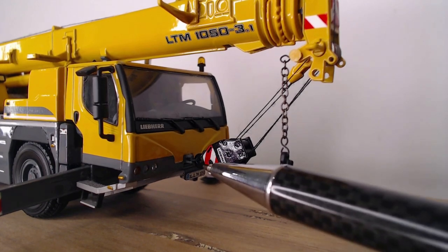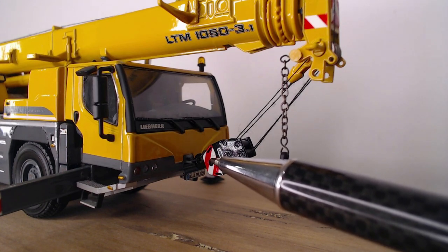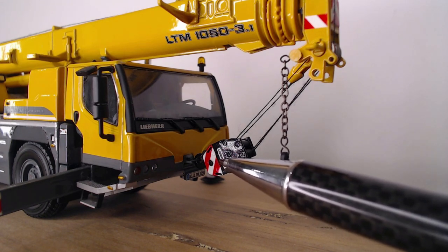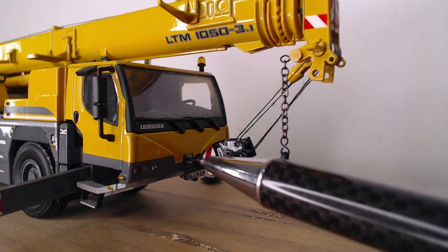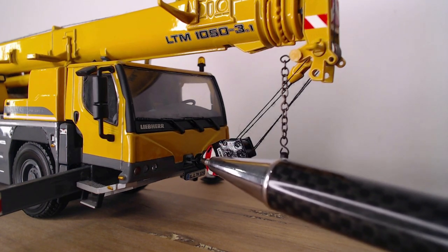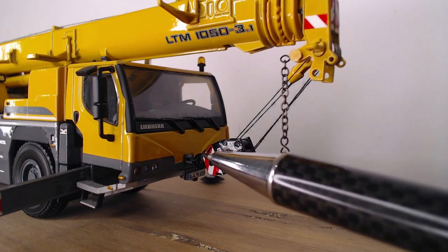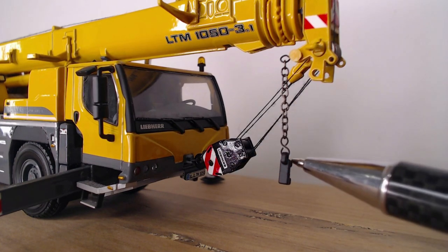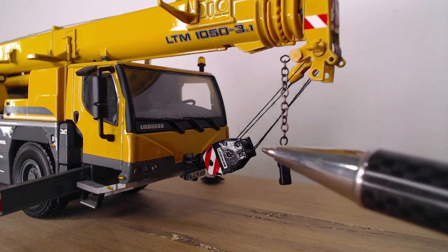So first of all, if the crane operator has looked at the job and said, yep, this is where I'm setting up, you want to take this hook off. But a good tip that I always do is, if it's your first time at that crane, take a picture of how it's hooked up. Sometimes the hook is hooked up with three or four chains, one to pull it in, one to hang it there for travel. Sometimes the hook has got a ratchet strap, but it's on a whalebone hook or ram's hook, they call it. Sometimes you have two hooks here, so you have an auxiliary hook and a main hook, and it's tied up a specific way.